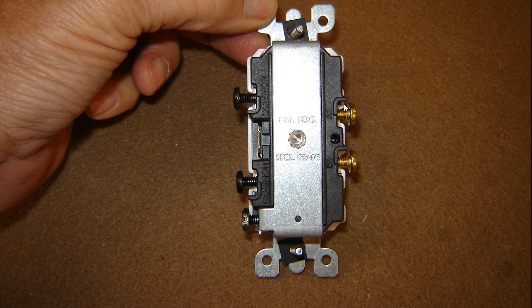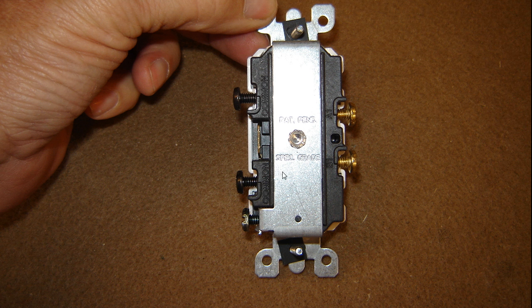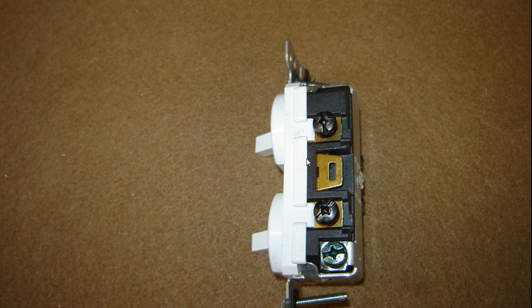On this side, one of your switch legs will go up to your bathroom light, and you're adding in your exhaust fan — the switch leg going up to the exhaust fan would tie into this one here. In that case, when you turn this switch on your bathroom light comes on, and when you turn that switch on your exhaust fan will come on.